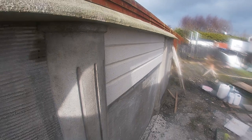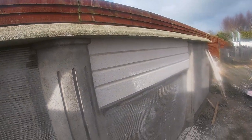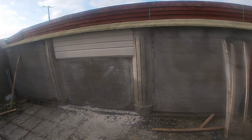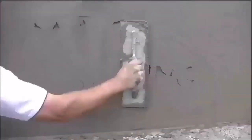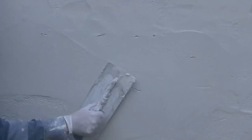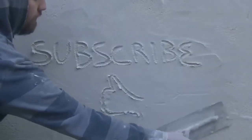If you're going to use a board, make sure it's really scraped down and clean before you go ahead with your K-rend on it. One big mucky bit on a wall and you'll be scraping it all back off and starting again. The product isn't the cheapest, as anyone who's bought it will know. Wash the mixer out after you use K-rend — that's a big must. So I think I've covered everything on the mixing side of things, so I'll catch you on the next one.